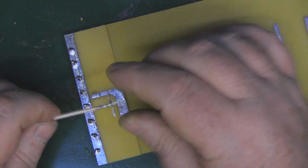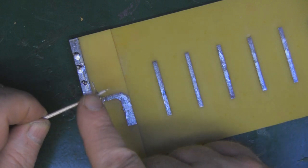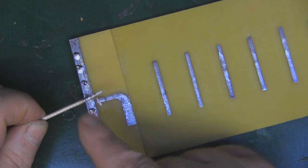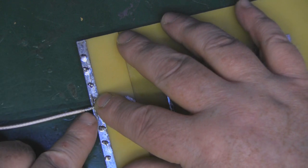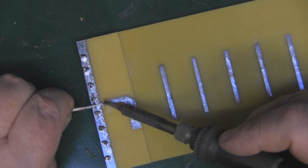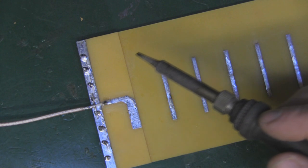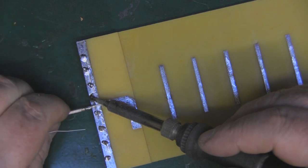I'm going to solder onto this PCB to insert it into the longer waveguide. I've tinned up all around here and tinned up the end — about 10mm of the outer braid exposed and tinned — because we're going to solder this down onto the PCB board. Solder the center conductor on first and that'll hold it in place, then solder those two little arms down onto the reflector.